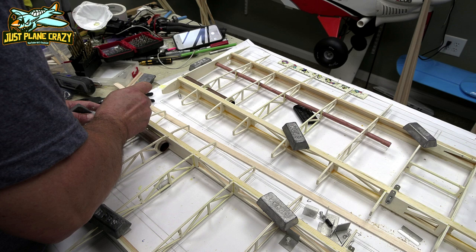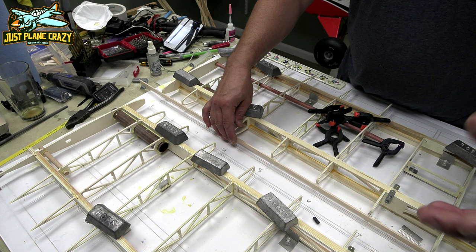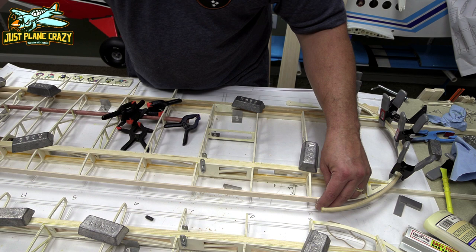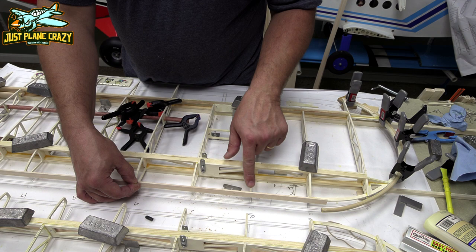All right, now we're going to go ahead and glue on our 3x15 strip onto the nose and then make sure that everything is squared up. You will see right here on these outside edges, there's a part that sinks in, and that's where that thing's going to go up to for a max distance or length, and then that'll get sanded down at an angle. So we want to make sure that these things are kind of at the top and lower edge centered on the forward part of all those wing ribs. So we're going to go ahead and let's glue all this stuff in.